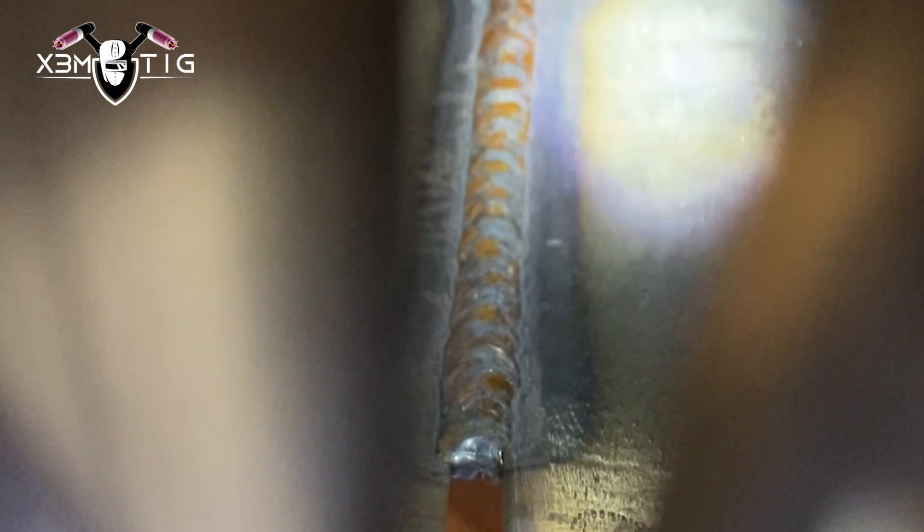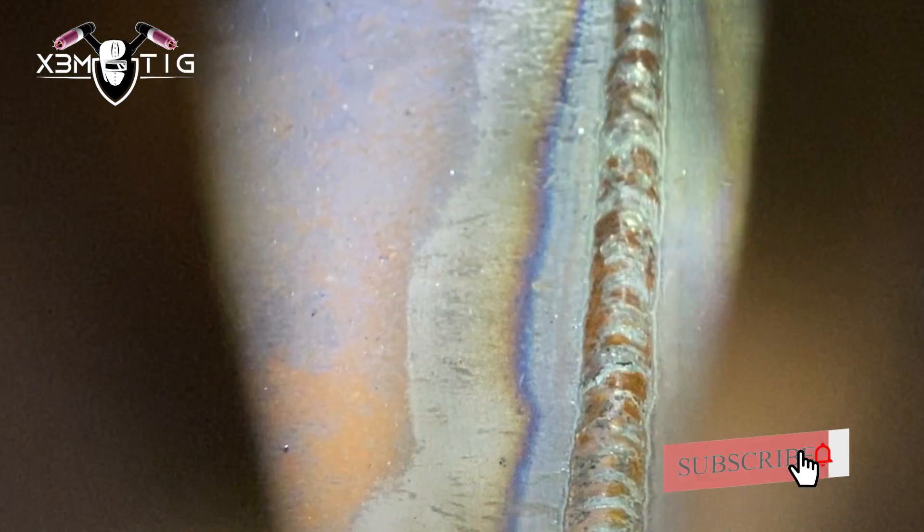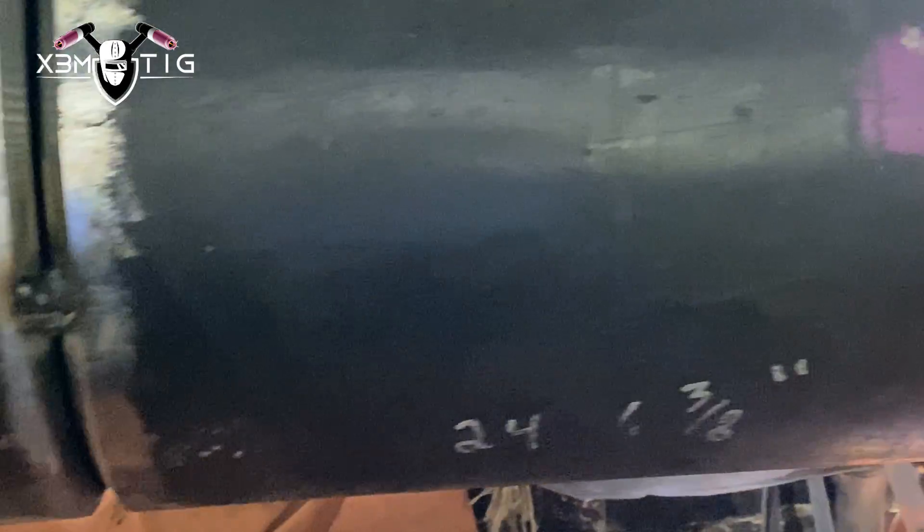This is the root on the second joint — that's what I was talking about. The root is a little bit heavier, that's what I like, so I eliminate the worry for suck-back. I like to run hot, 180 up to 200, it all depends on the pipe. Now I'm going up to the tack, still going freehand up to eight or nine o'clock, then I switch to constant feed, lay wire, or dip technique — all depends on the gap. If it shrinks, I usually switch to dip technique.